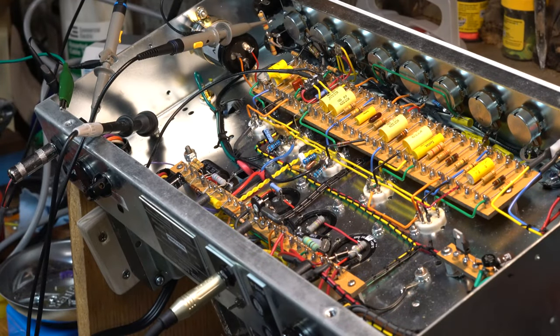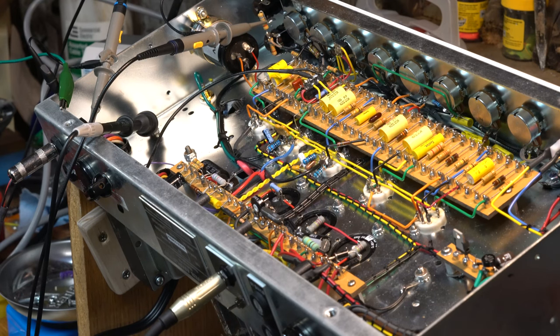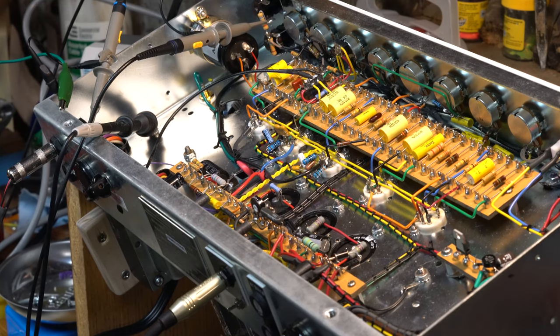So the one thing you can probably now hear — I've got it all hooked up with the reverb connected. The source of the buzz is the boost, not the reverb. I had a sine wave inputting into it and I don't see any dirt on the line, but when I adjust this reverb, nothing. But the second I put the boost on, hear that nice buzz. So I've got to track down what's causing that buzz. Probably the first thing I'll end up doing is chopsticking around — find my chopstick and start poking in here to see what we get.